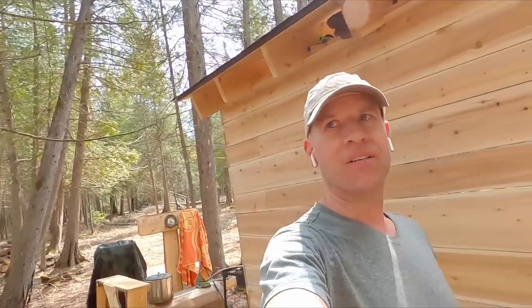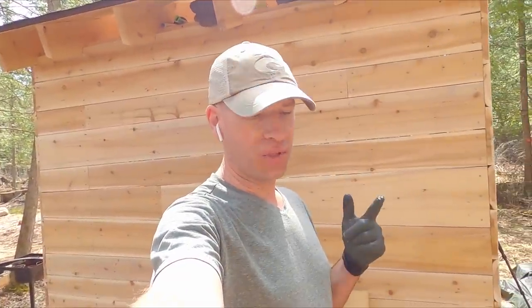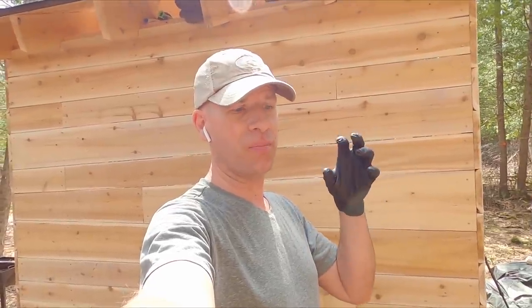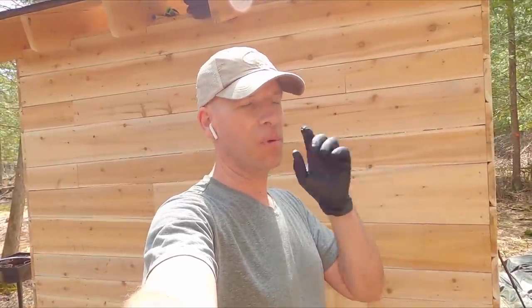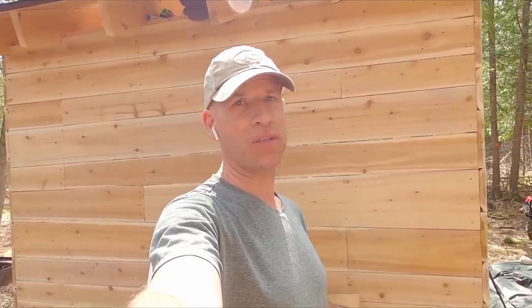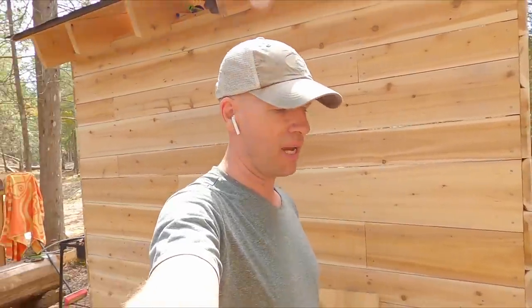It's crazy. Even the floor in the man cave, so I put the floor in the fall, maybe a month or so before it started snowing. And those are big fat boards too, so they shrink up a lot more than a little skinny one. But I put the floorboards in, and then I caulked it all, just a little tiny gap, and it's been there all winter and it hasn't changed at all. And then the last week and a half, there are probably more than 1/4 inch gaps in the floor. I mean, it makes sense. You get some warmer, drier weather and it does that. But having the heater on in there all winter, I guess I thought that would have dried it out a little bit, but it's really shrinking up now.